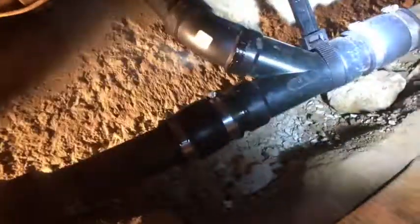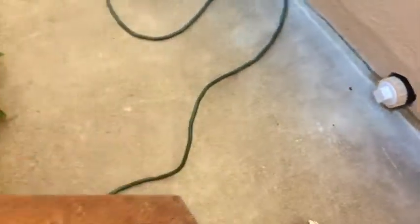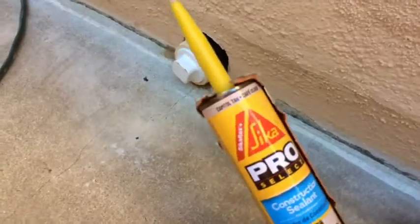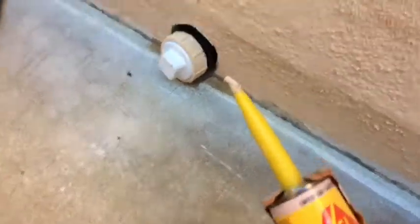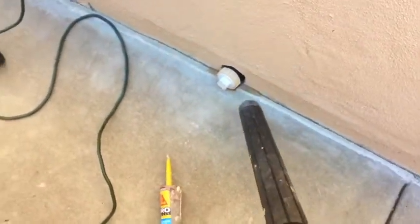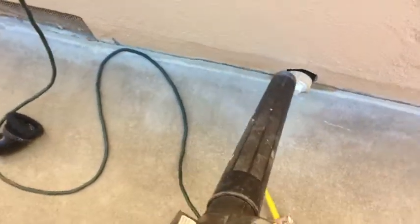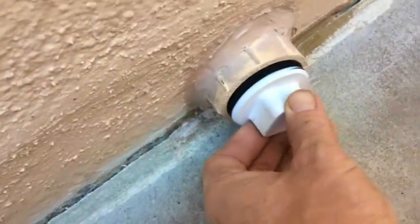Got the tub running full steam — it comes in right over here and we have to check to make sure our work is good, check for leaks. Looks good — that's not gonna leak. For good measure I added one more pipe hanger right here. Outside again, the last step is to use a nice sealant. This one happens to be a similar color to the house — it's a polyurethane sealant that can be painted. My shop vac works as a blower, so I want to blow that off because nothing sticks to dust.